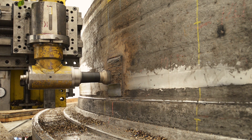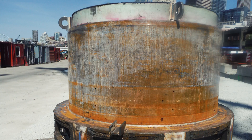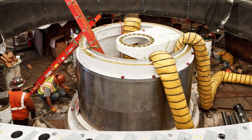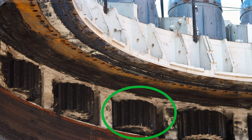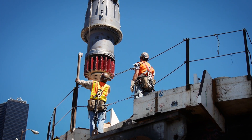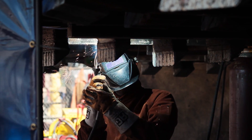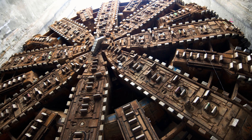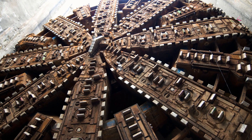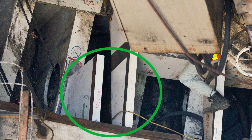We also found some other things that we wanted to address and correct once we disassembled the machine. The center pipe had damage, so we replaced that. There are drive motors and pinions on the ends of those motors, and we saw some damage to the pinions, so we had those replaced. There was also a good opportunity to make some changes to the cutting tools configuration so that the cutter head performs more efficiently during the balance of the tunnel drive. And we needed to add steel reinforcing plates to add additional reinforcement to the TBM.